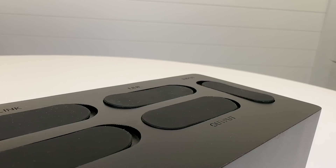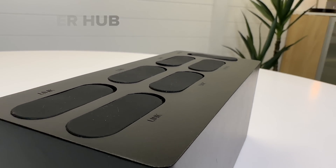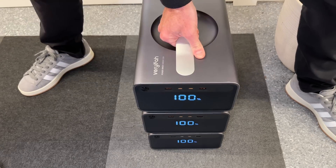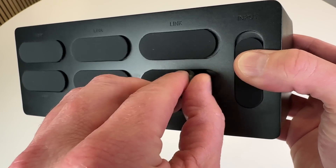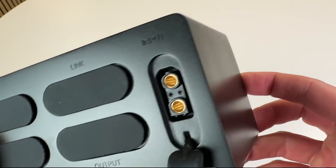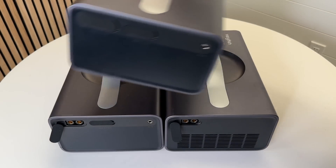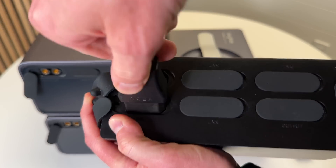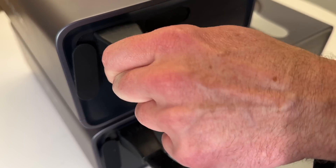The Power Hub has five high-power VE30 ports to link up to five battery modules so they charge and discharge together. There's a VE30 output port that pushes all power to a high-power brick like the inverter, and a VE24 port to connect multiple wall chargers or solar panels from their respective hubs. You just connect the batteries with cables to the link ports and connect the inverter to the output port. Each module communicates through extra pins on the cables, so it's smart enough to detect a hot battery and seamlessly switch to a cooler one.